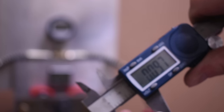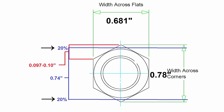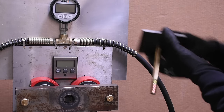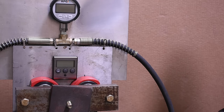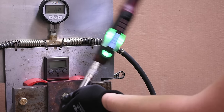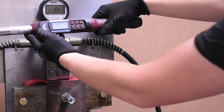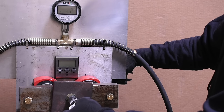Every tool used today is the same size, and the hardware we're tightening is coupling nuts made from as soft steel as you'll find on any hardware. The thread size internally — half-inch coarse thread on grade 8 bolts — is quite large compared to the outside hex, so the threads won't be the weak point; slipping on the outside hex is what we want. We're precision-rounding them to 40% using a jig next to a tabletop grinder. We're keeping this dyno in bolt tension PSI for finer resolution, but that works out to 11-to-1 in the foot-pound scale. This rig is pretty sensitive — even a plastic socket hang tag can register some torque.